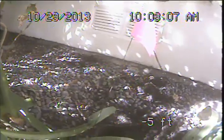Now, the main sewer line is the portion of the waste drainage piping that is exterior to the structure. It lies underground and connects the building drain line system to the public sewer. The building drain line system then is the portion or portions of the waste drainage piping that is underneath or interior to the structure. Our examination today is not focusing on the building drain line system, so if further evaluation is desired regarding the building drain line system, a licensed plumbing contractor should be contacted, or a specialty building drain line video examination can be set up through our office.